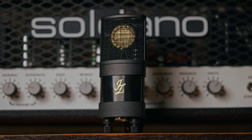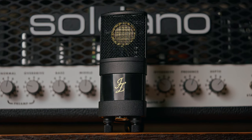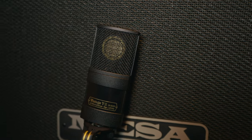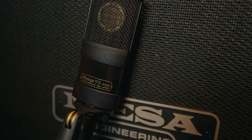The Vintage 11 uses Class A electronics. These are hand-built, and I love the design. You can get nice and close on something like a guitar cabinet with the included shock mount. So you don't have this huge basket and you don't have to be a ways away. If I'm using a multiple microphone system on a guitar cab, I now have to put that SM57 way back in order to phase it correctly. So I like being able to get right on the grill if I want to, and this mount lets you do just that.